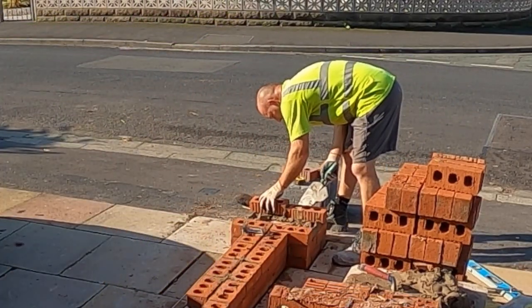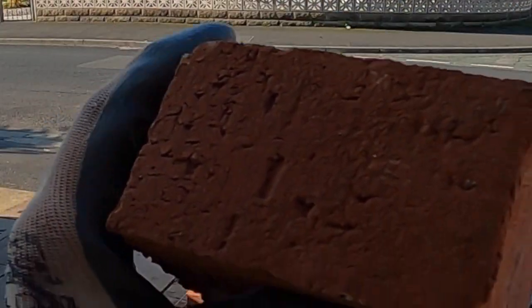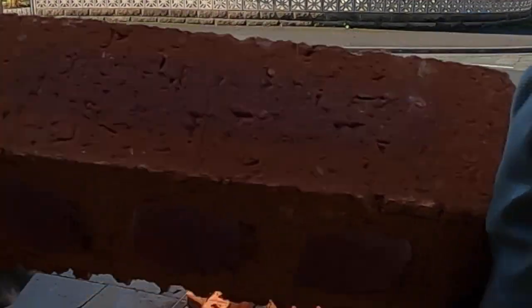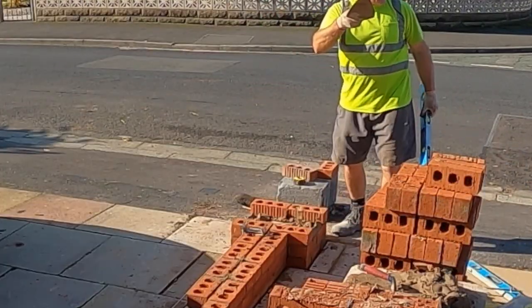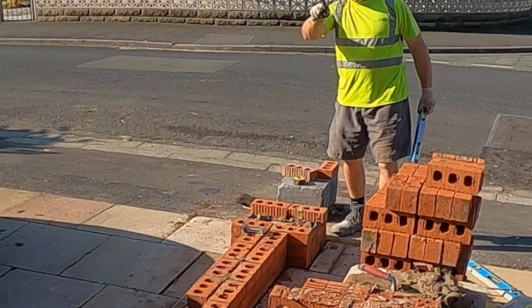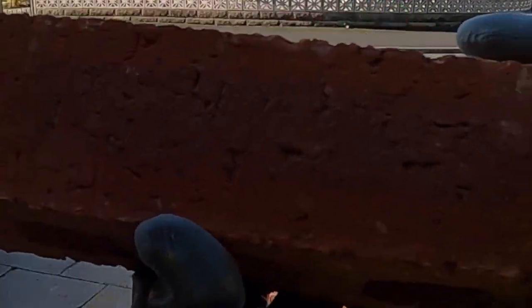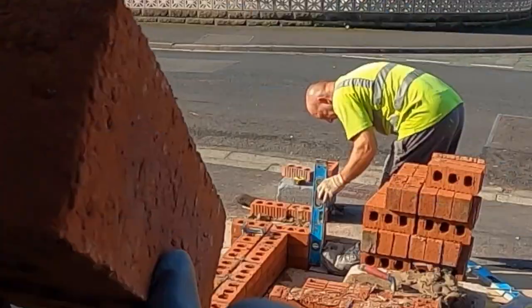Real quick one. These are the feather bricks with the right and the wrong side. So, looking at the feather edgings, that's the right way. If you want to learn more about that, we've got a video on the right side and wrong side of bricks. Check it out if you want to learn more about how to set a brick. And these are a bit more confusing, because they're a bit smoothish on the face, check the ends if you're not sure. Sometimes it's a bit harder to tell, like with this one for example. The sides usually offer a better guide on which is the right way.